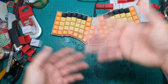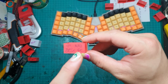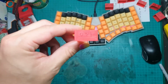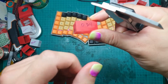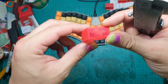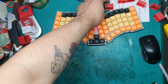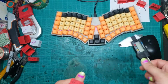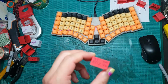So I decided to turn that off and repeat basically the same tests. So this is no compensate wall overlaps, one perimeter with 80% flow. You would think this is actually 80% off from 0.4. I'm getting 0.34 on the walls. So that is 20% off from perfect. So if you actually just turned that setting off and did your E-steps calibration and printed something, you're going to get much more accurate extrusion from Cura just by turning that setting off.